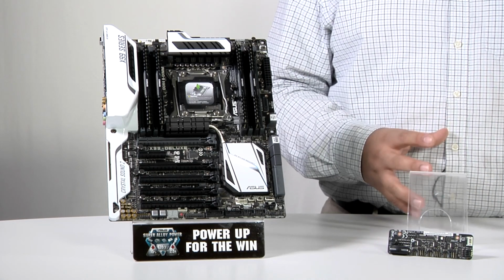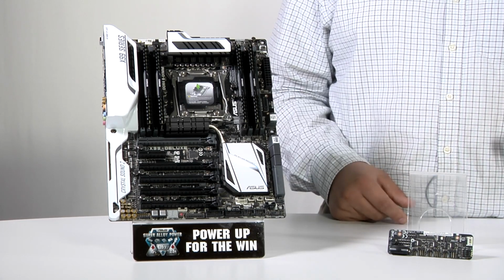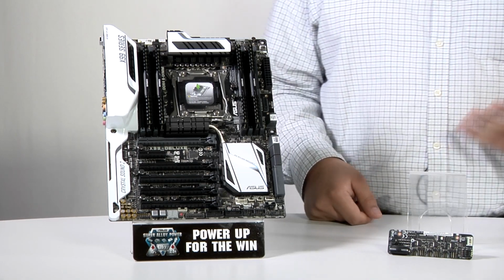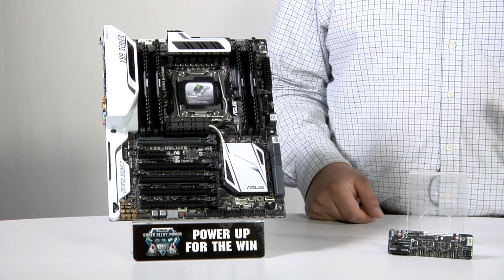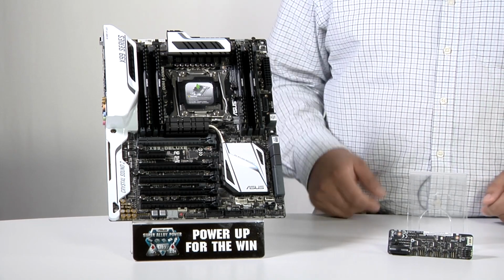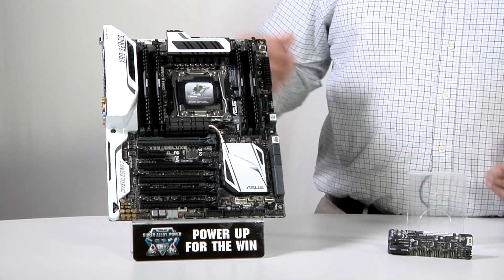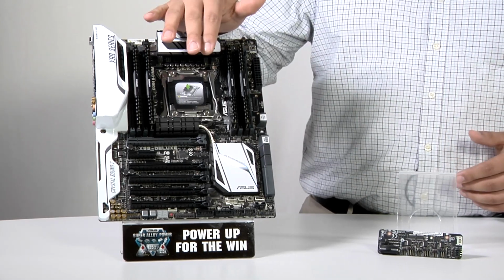So whether it's a DC-based fan or a PWM fan, you have complete control flexibility both in the operating system as well as in the UEFI. Now, new for this generation, we've incorporated our Z97 class of improvements. That means we have the ability to let you map the temperature input for the actual fan header. Take for instance, here in the top corner, we have our CPU fan headers, and those would traditionally be controlled by the CPU temperature input, which is what we would want. They would respond to the CPU temperature.